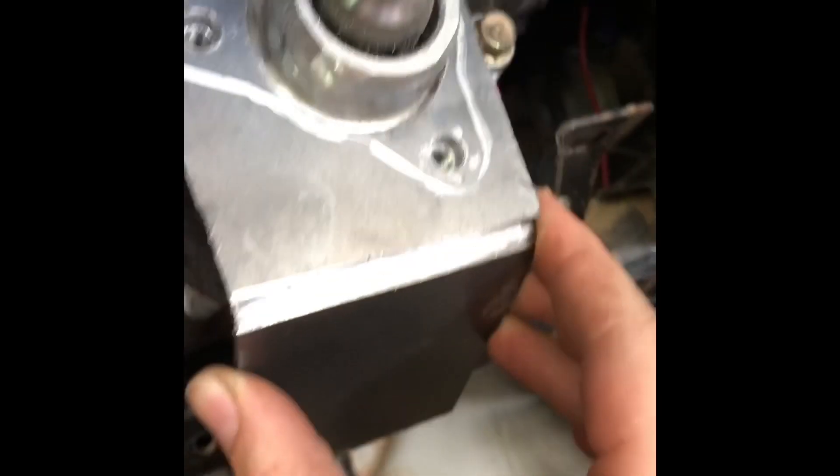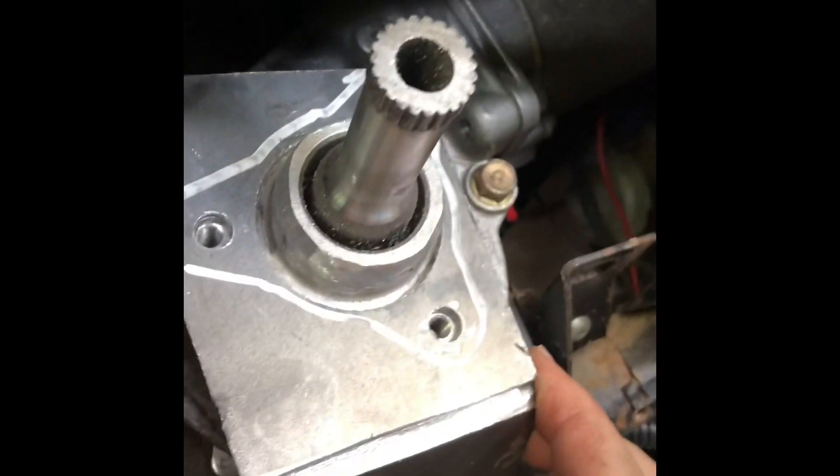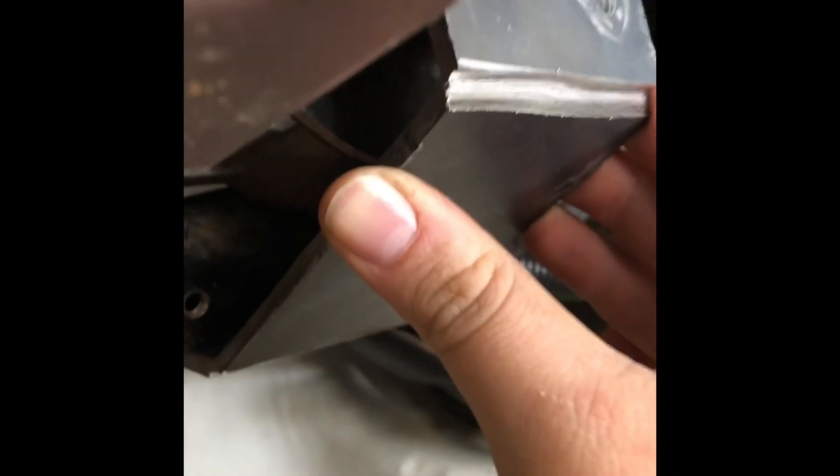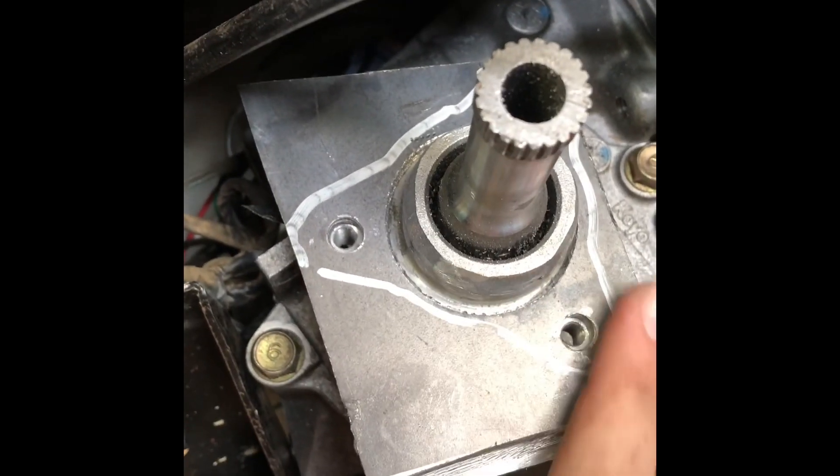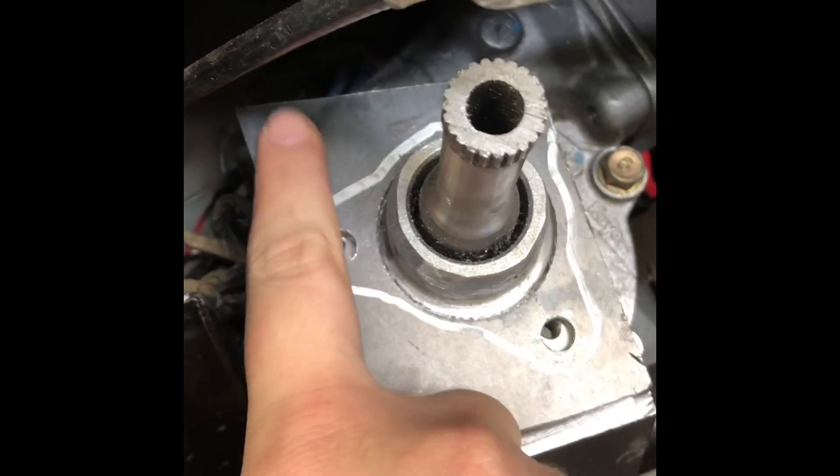Calibrated guessing turned out pretty perfect — that's exactly where I want it, pretty lucky. So I can put a gusset here and it looks like I can maybe put a small one here. I might just try some really strong welds on a high heat setting and see if I can get it in there. So I'm gonna go ahead and weld these up.